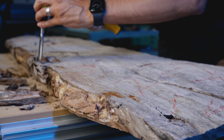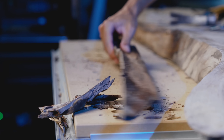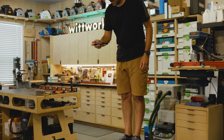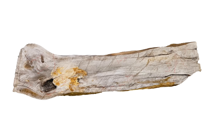First, wood needs to be dried evenly. Second, it needs to be dried to the point where fungus dies. And third, as you can see here, it needs to be dried above 135 degrees to sterilize any insects who are living rent-free inside.